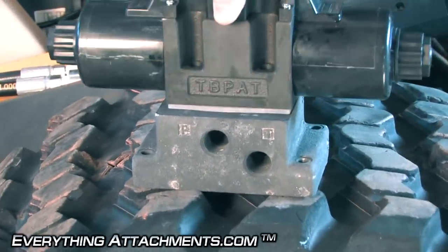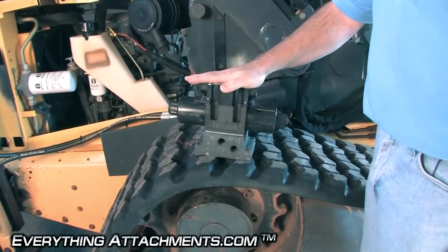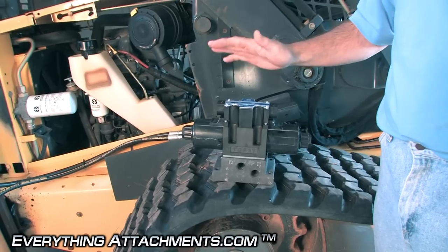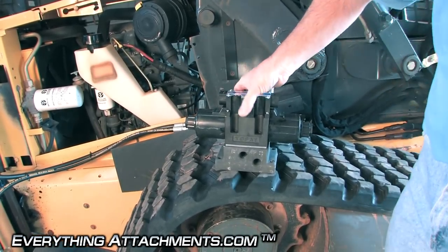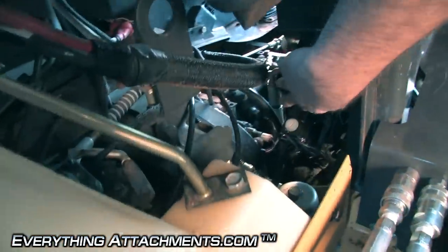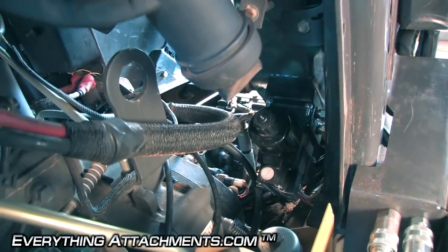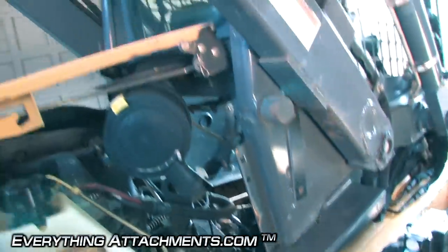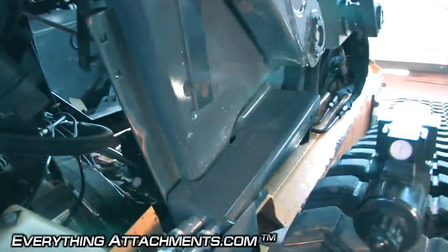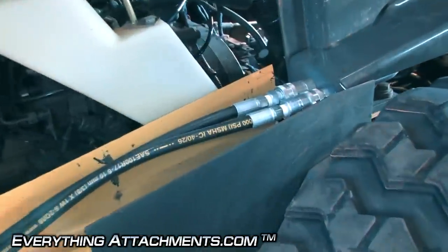This is about a foot long and is going to bolt on the top. This is doing the work — this is telling what the hydraulic lines to do, and that's done through 12 volts. You'll have a switch on your handle to decide which direction you're going to go, whether your stabilizers are up or down. We've got this mounted neatly right in here. This is your control valve, mounted up under the right-hand side behind the operator. This is an LT185B New Holland machine. Almost all of the New Hollands are constructed pretty much the same, and you've got a lot of room under the seat compartment, so we were able to sneak this big valve in there so none of the hydraulics or the heat are inside the operator's compartment.